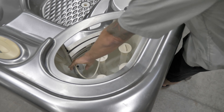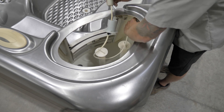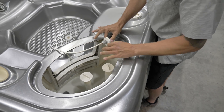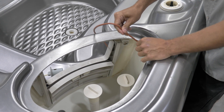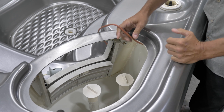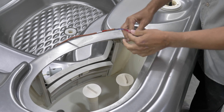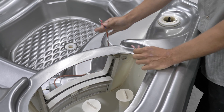Now that we've shut the breakers off, this will be the salt cell — follow the wire where it goes through and you can usually just grab it with your hand and twist. We're going to take out the big plastic nut right here and then slowly pull. If it stops and it's binding on something, that's when we have to take off the front panel, but if you're lucky just keep slowly working it out until we get to the connection.